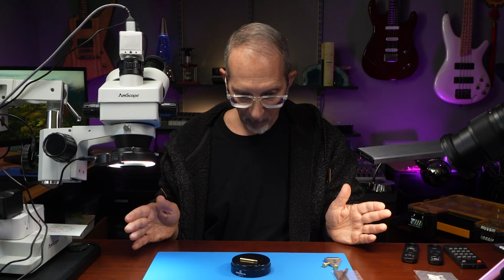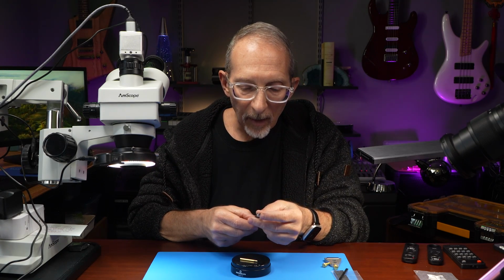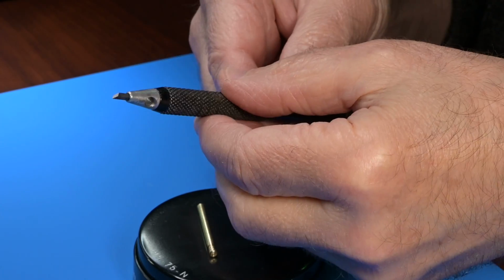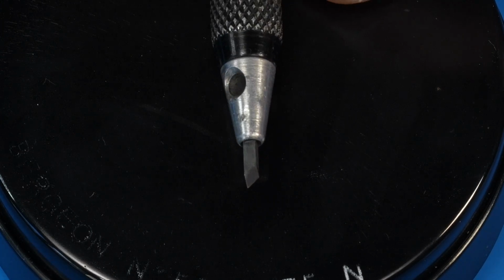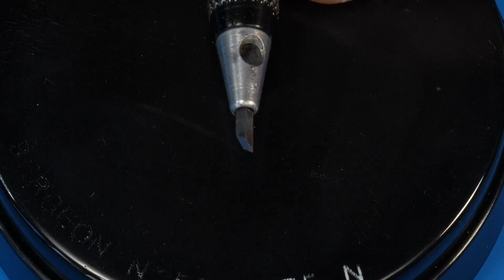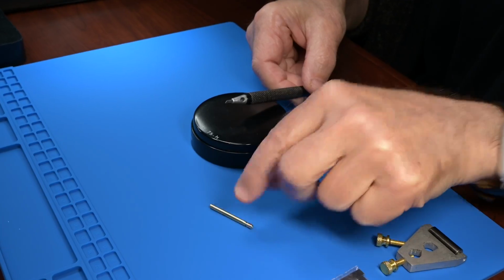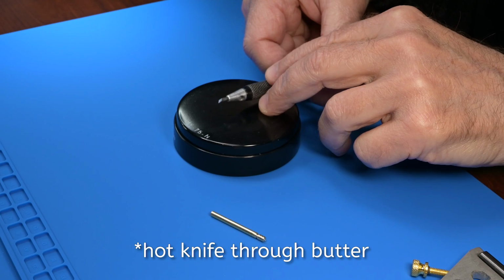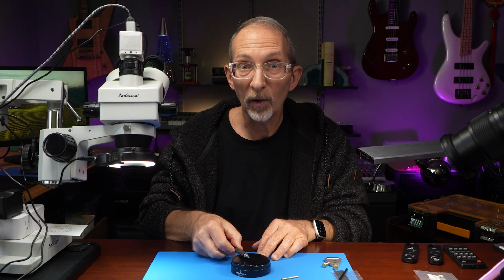So where do we go from here? Well, first thing is I really need to see if I can get that other graver tip looking better than this, because I know this just isn't sharp the way it's supposed to be. My concerns are that in grinding it, perhaps I change the temper and change the hardness. I'm only cutting brass here, but it should cut through that brass like a knife through hot butter. And it's not, but that's okay. It was fun to go through the motions.